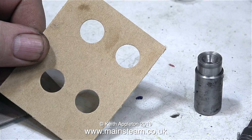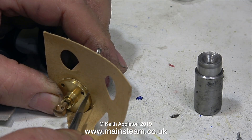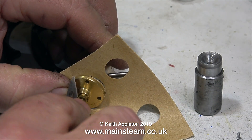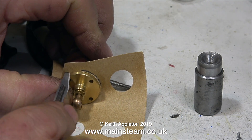By the way, this is one of those envelopes that you buy that hold photographs — the kind that says 'do not bend' on the front. It's absolutely ideal for this job because the cutter goes through into the cardboard and doesn't blunt. In this clip, using a scalpel which is extremely sharp — health and safety warning, be very careful when doing this — I'm roughly cutting the external part of the gasket to shape.